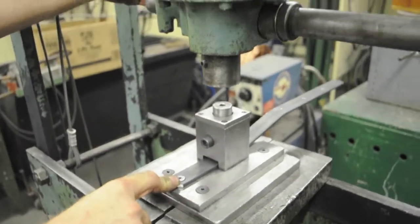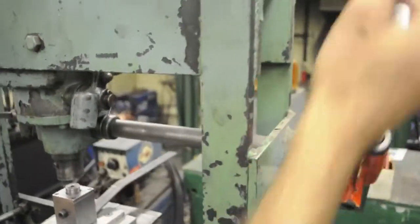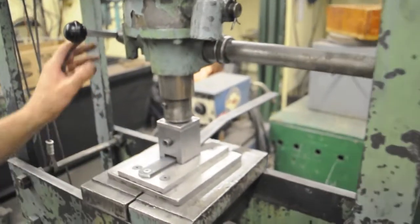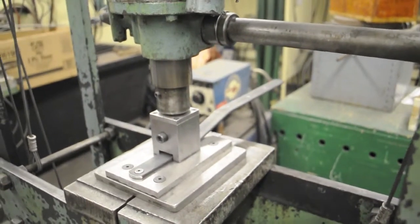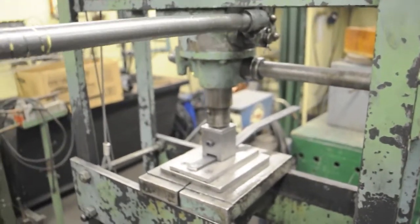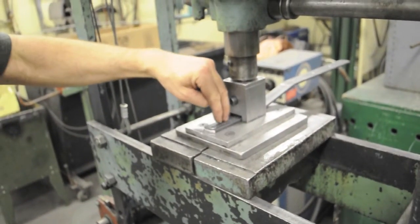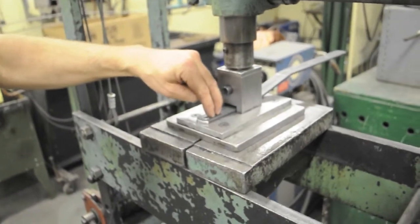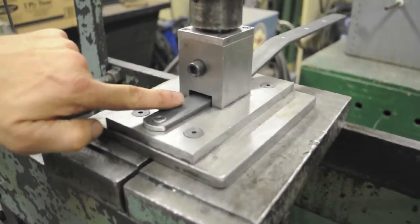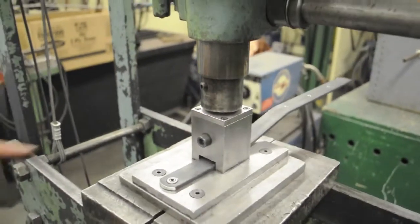Okay, bring the black lever forward. Rotate the ram down onto the tooling. Put the lever in the back position. Then take the handle, and what you want to do is use the hydraulic press. There's a punch that's the shape of a straight slot screwdriver in there. If you look in the hole, you may be able to see it. Well, I know you can see it. I don't know if we can catch it with the camera. But what you want to do is look in there.